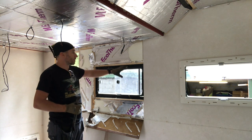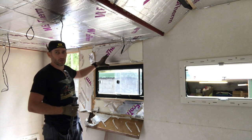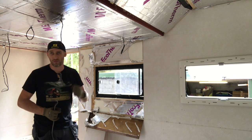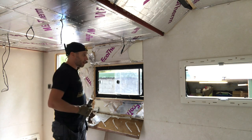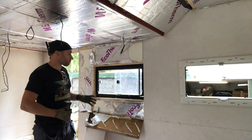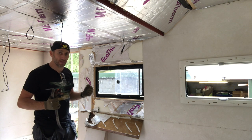I want to put a 9mm ply over here and expose the timbers to see what kind of structure I've got below, because I want to get a screw to the wall. I want to screw the bottom walls up, screw covers along here and along that wall, making sure I'm screwing into something that's going to hold. I also want to make the box a little bit stiffer.